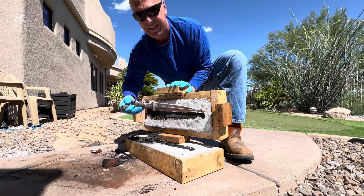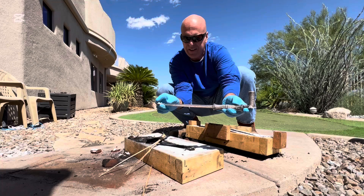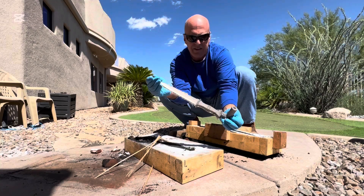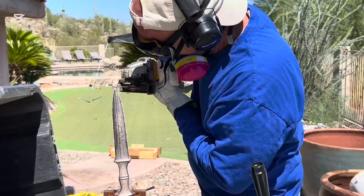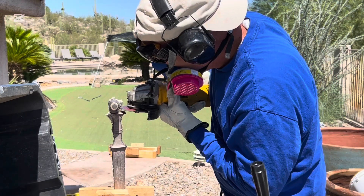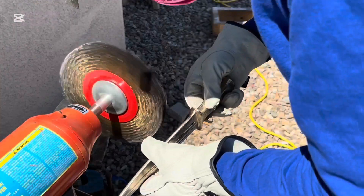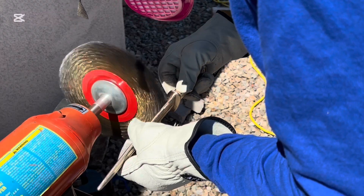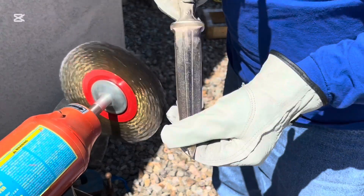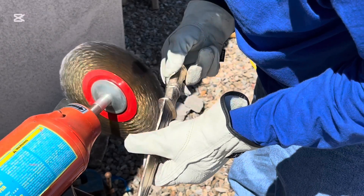As I looked at the dagger, I was totally stoked with how it had turned out. It was very well formed. I could see where the liquid metal had gone in, solidified, and the entire length of the blade had formed just like I wanted it. The next step was simply to clean off all the extra metal and polish it up a bit. I cut the excess metal off the tip of the blade where some of it had gone up the vent hole, and then cut off the excess metal that went into the handle where the metal had gone in. I did quite a bit of grinding and brushing of this dagger to get it cleaned up to where I wanted it.